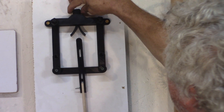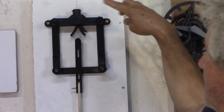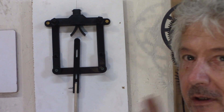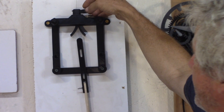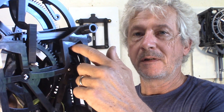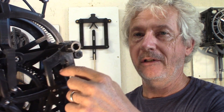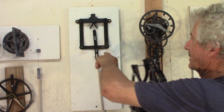There's a fine tuning option at the top when the clock is close to being in beat — you can finish the tuning by adjusting this without stopping the clock so it can still go. This nut will be up here with two or three millimeters of adjustment. The clock sits on those two studs, and the back frame has a circular shape with a little bit of leveling for fine-tuning. The crutch goes into that slot.